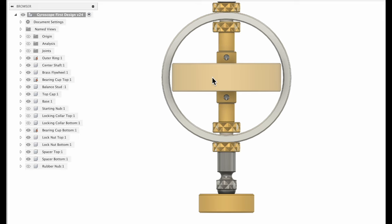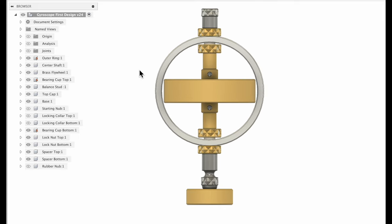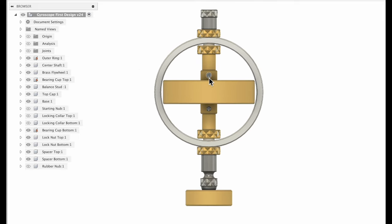So there isn't a good way to tip this into place and get it up in there once you have that shaft pressed on. And if you look at Clickspring's second design where he built the full gimbal, you'll notice that he's using set screws to hold that on as well. That increases the amount of brass you're going to use. Now that I'm leaving a hub sticking out both sides, I maybe could have gotten away with a hub on one side, but I like the symmetry, and wanted to keep it looking the same top and bottom.